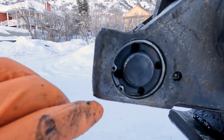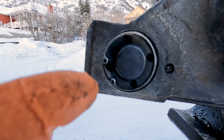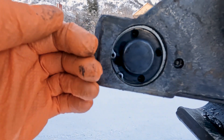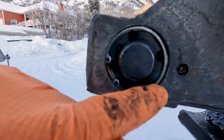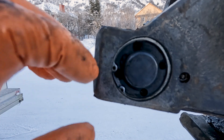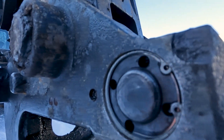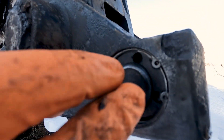Now that I've got it cleaned out, we can see a little better what's going on. This piece right here is the bushing - it's threaded and screws into the main housing. It backs off and screws against this snap ring, which is a retainer, and pushes on that ring so hard it'll actually bow it out. I've seen it actually crack the casing where the snap ring fits into the groove in the housing, breaking the casting out, and then we have to replace the whole thing.